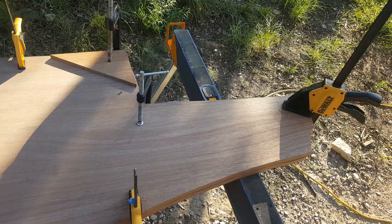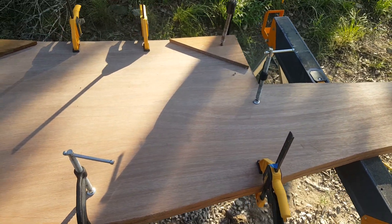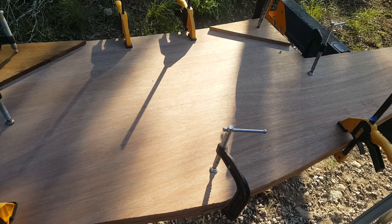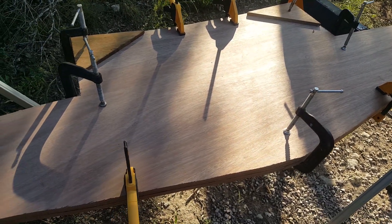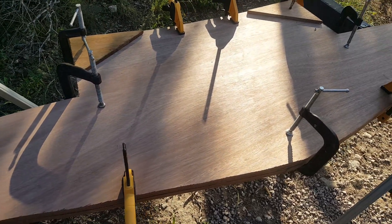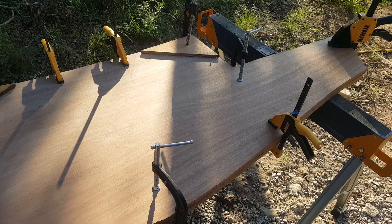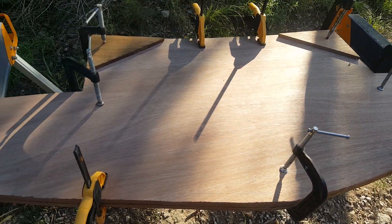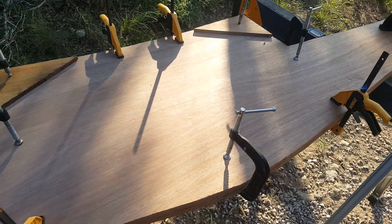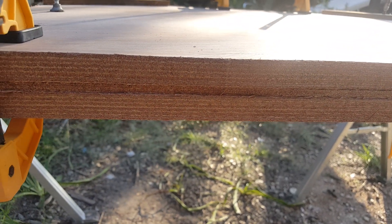You can also see here I've pre-positioned a boatload of C clamps — I've grabbed every one I could find — just to make sure that when we apply the epoxy resin we get a really good squeeze so we know there aren't any hollow spots in the center. I put a little bit of torque on these C clamps and went around 100% all the way around to make sure there weren't any gaps anywhere. This wood from the factory is very straight, and as you can see up close there's not really any gaps here.